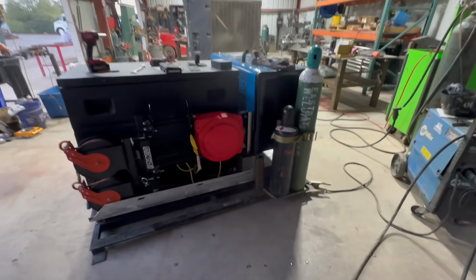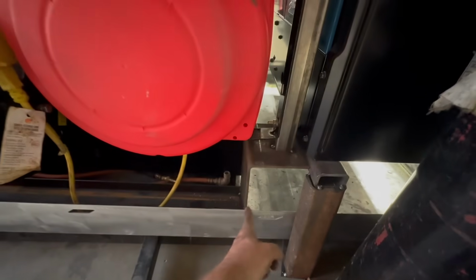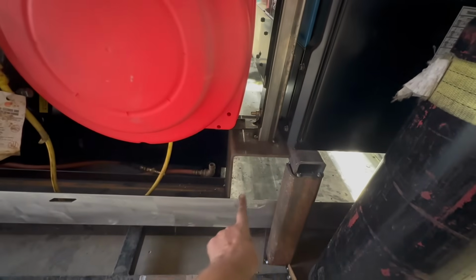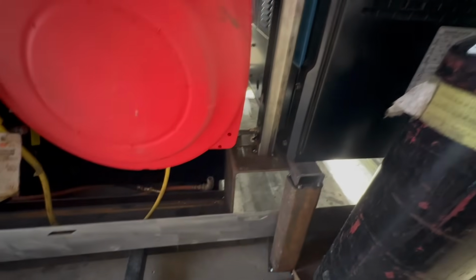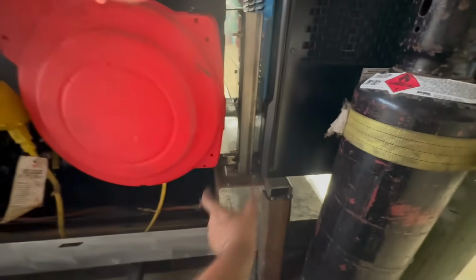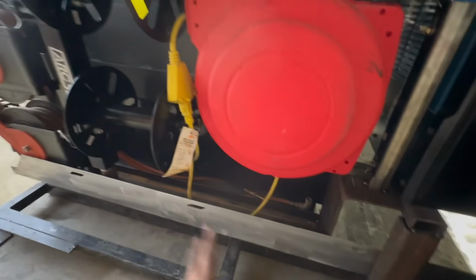All right, so here's kind of what I came up with. It's all tacked together, so I don't want to pull on anything, but we got a piece of 1/4 inch here that we formed and ran in. We cannot weld these two together because this slides. However, this adds a little bit of protection for my box that's going to go down here, so you can't grab stuff out of it, I guess. A little bit of safety, but it worked for that because we needed that little extra room there. So it'll need a gusset, a few other things, but all in all looks good.